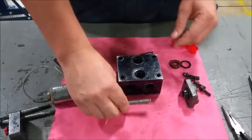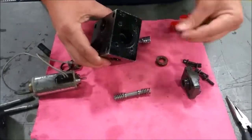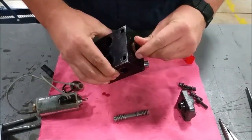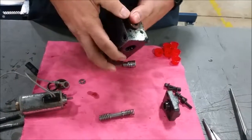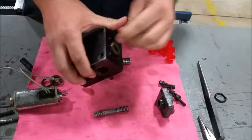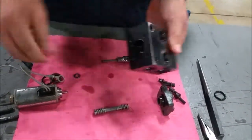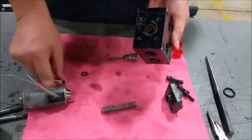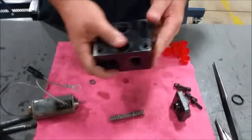Some characteristics of this valve: it has return springs, and it also has seals and O-rings. It goes into the system like this to seal off the actual ducts. It's on both sides, and it seats with an O-ring so that hydraulic fluid stays within the system.